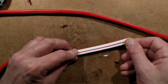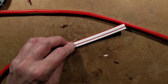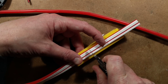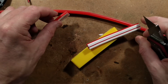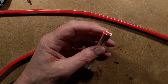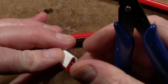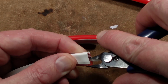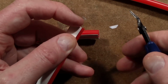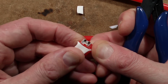Say you wanted a short piece - you could get a knife, take it to the edge of the bench. I'll put it on a USB power bank, flip out a handy blade, place it on that little line and press down. That slices through it and that's you cut the neon to length. To terminate it, the best way I've found is to take a pair of snips on the side facing away from the tape, slip the snips into the side of the tape, cut a wee chunk out, fold that up - and that gives you access to the two solder joints on the end of the LED tape.